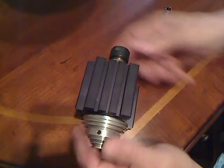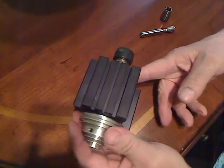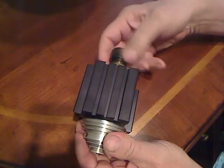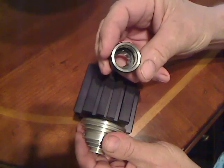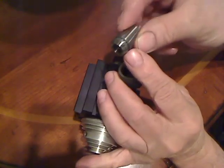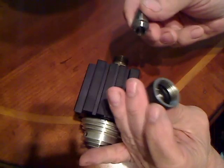This is a demonstration of the ER collet system. We have here a TAG ER spindle. We're going to remove the closer — it's machined special in there because the ER collet has a little notch around it, and that notch fits into that machined-out area.